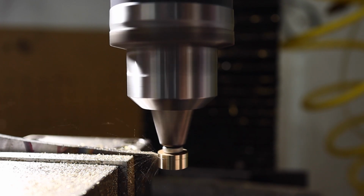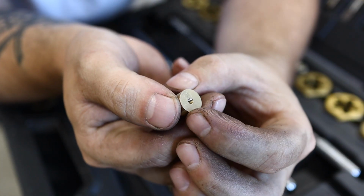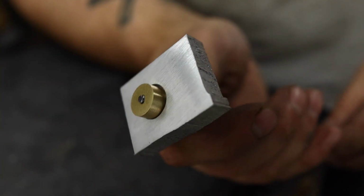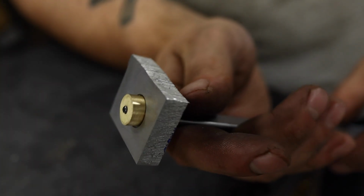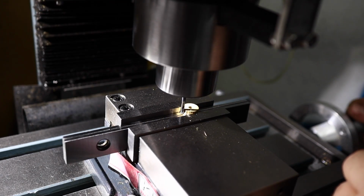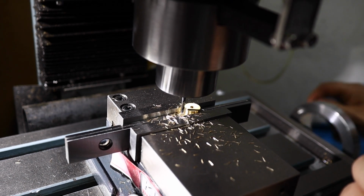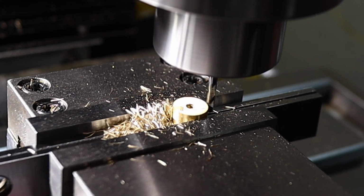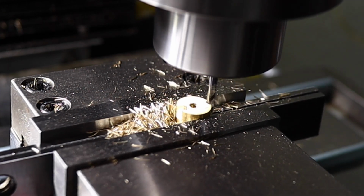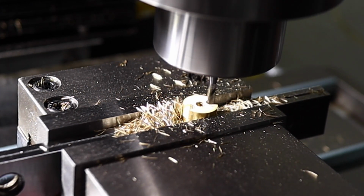Now there is no way to actually tighten this nut down. We don't have the room there to put hexagonal facets on this nut, so I'm going to use the traditional technique, how you would approach something like this, and we'll mill 2 notches into the nut. Then we have to design a custom tool, a special tool to mate with this to allow us to tension this nut at the end of our leather stacked handle.